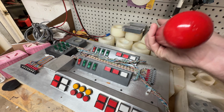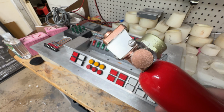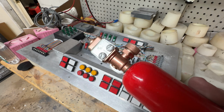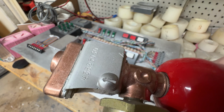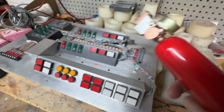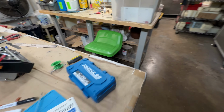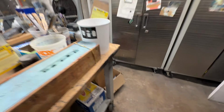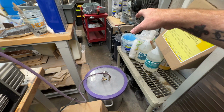Here's something that we make. There's this little bottle that goes behind the thing, and look at the detail that goes into it. This is all cast resin. It's 100% cast resin and then hand painted. But look how good that is. The serial numbers are in there. Pretty impressive, the way we've gotten that. And how that works is, I don't think I'm giving away any secrets to people who know how to do this stuff, but everything goes through both a vacuum and pressure chamber.